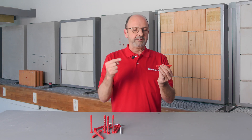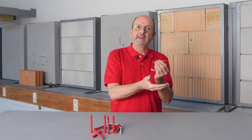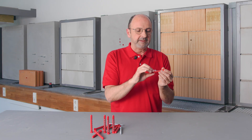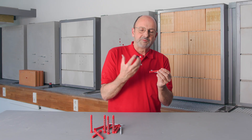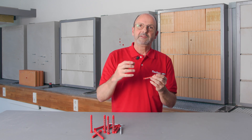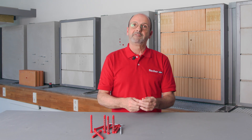It works like a plastic plug. When you screw in the screw, the plastic moves out, presses against the wall of the hole, and also fills the voids. The steel parts have a special form — they can also deform and press into these little voids, forming little power cones, which give it extra grip, extra safety, and allow it to work in a fire.